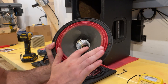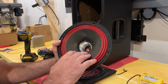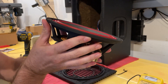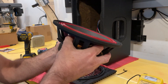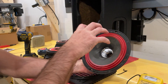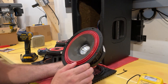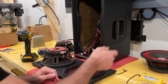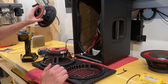As you can see, the old speaker did take some paper damage. The center cone cap did end up coming out and getting lodged in here, but this is fully locked up. You can see how it protrudes from the top and won't go anywhere — it came out of the cage at an angle and got stuck against the metal. The coil still has correct resistance, but that's not going to make any sound, or if it does it's going to make a really bad sound.